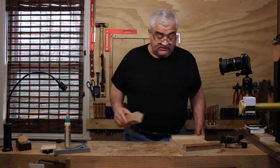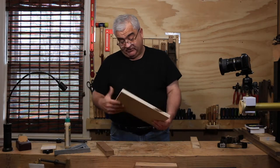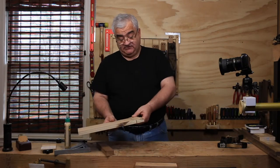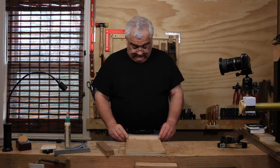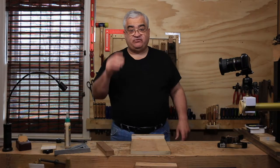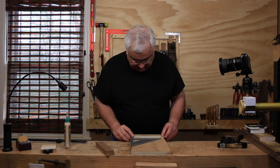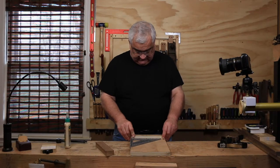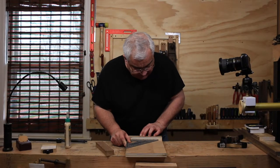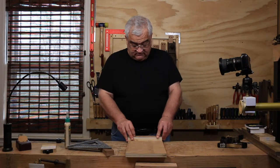What you need for this is three pieces of wood. This is a better quality piece of plywood — looks like Baltic birch — just a scrap. You build this with scraps. All I did was take a piece of plywood and cut the end off to make the cleat. In theory it should be square, and the squareness of the cleat doesn't really matter if it's canted slightly — it's not the end of the world. But we're trying to be exact here, so let's do the best we can. I'm flush to the back and sides, and it's pretty darn close.